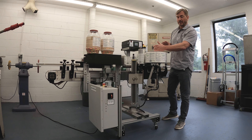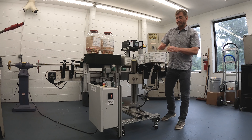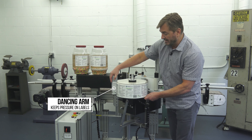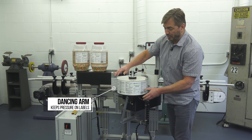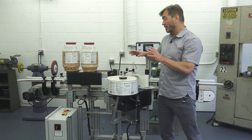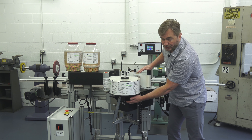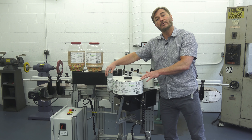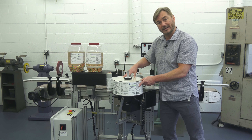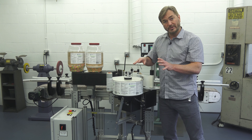On our unwind assembly, we can take it off and put on a fresh roll of labels. We then go from the unwind assembly to a stationary roller and our dancing arm. What the dancing arm does is keep pressure or tension on the label roll, meaning you're going to have the same amount of web tension throughout the entire roll. There's a friction belt underneath and a spring connected to the dancing arm — when the dancing arm is pulled, that spring releases the belt and allows it to spin, giving you the same web tension through the entire process.